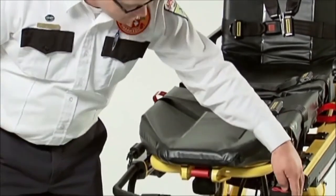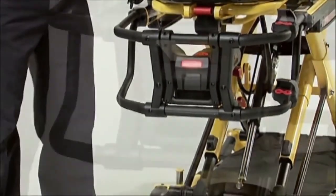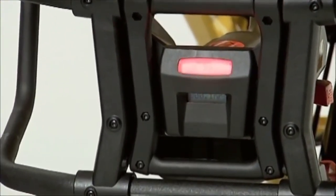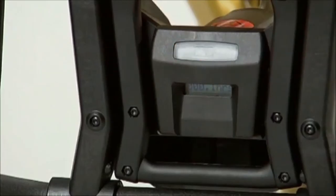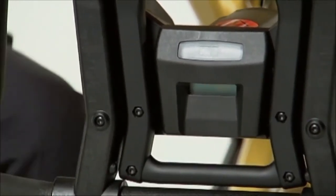The SmartPak has no memory and performance is not reduced by repeated partial discharges. Nevertheless, best practice is to keep using a SmartPak until the amber light on the PowerPro XT indicates it's time for a freshly charged SmartPak. Do not try to use a SmartPak for service calls after you've seen the amber indicator, or you may shorten the SmartPak's life.